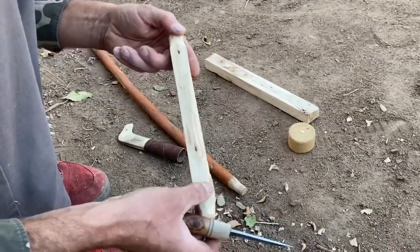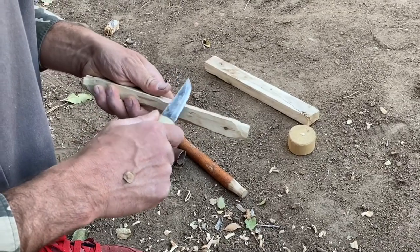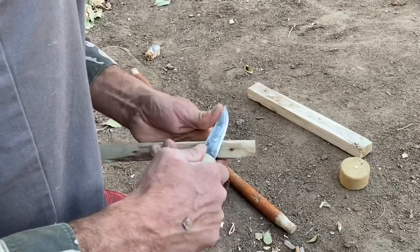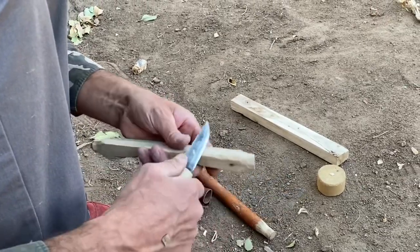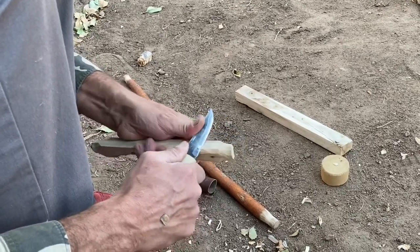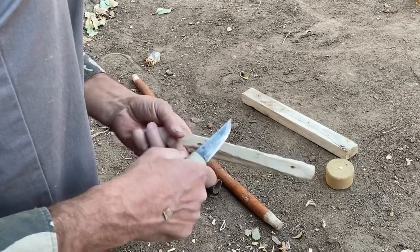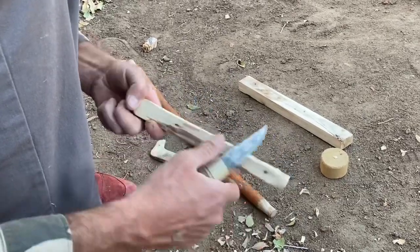So you actually wanna reverse it and carve with the grain. And so that anything that you're carving here is actually gonna wanna split out towards the surface if you do start splintering bits off. And then you won't mess up your spindle that way. And so the best way to do that, if you don't readily see the way that the grain is going, is just to proceed slowly, taking little chunks and just kind of whittling away, but not putting tons and tons of force into it. So then if you ever do see a big splinter coming out with the grain that's diving deeper into your spindle than you would want, you can just stop it before it does split that way and splinter.